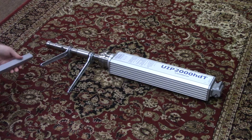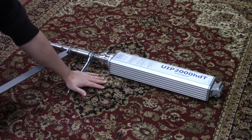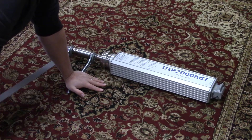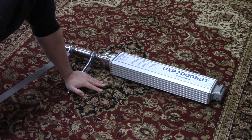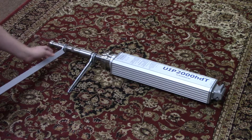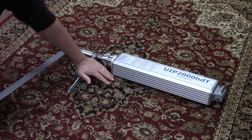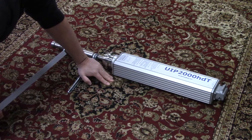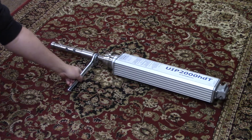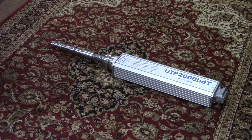I'm going to put the bar on to create more tension, then just push down, tightening it. I'm going to apply the same principle to the sonotrode — once again tightening it. To dismount the sonotrode and the booster, it is the same principle.